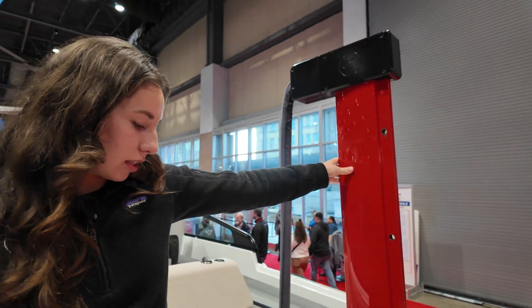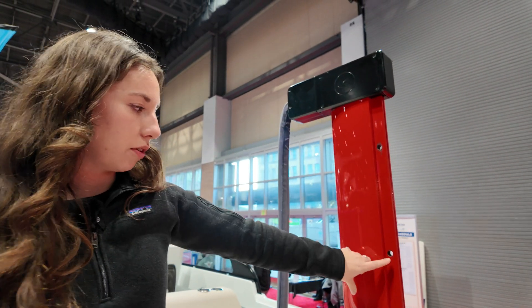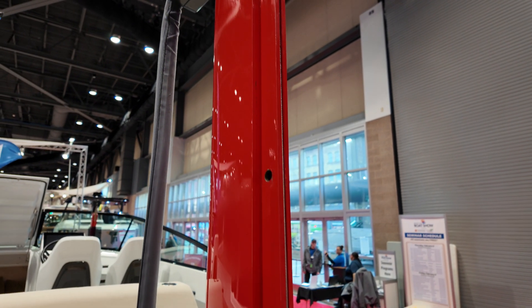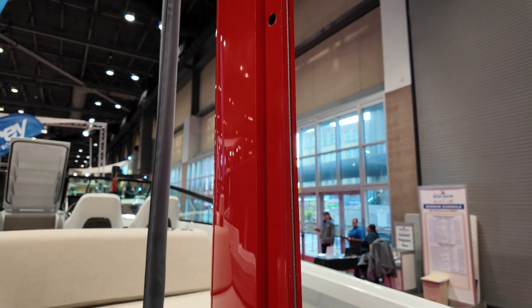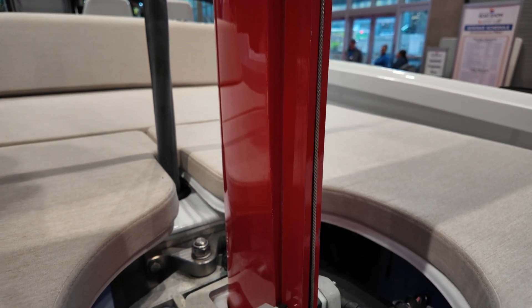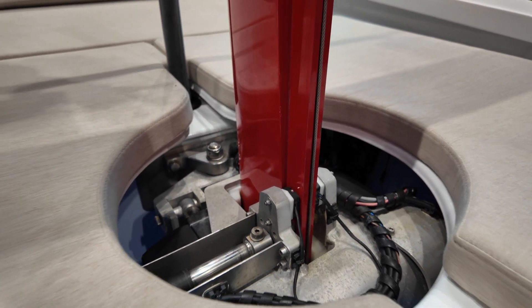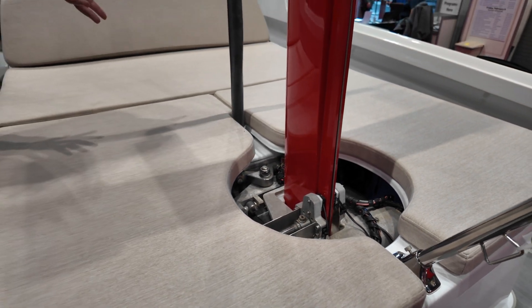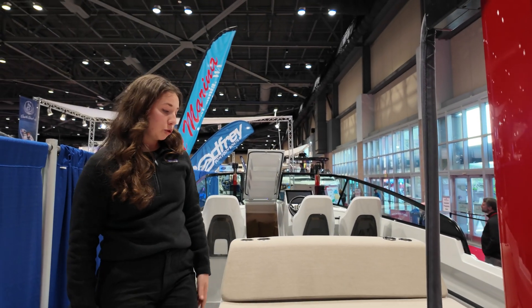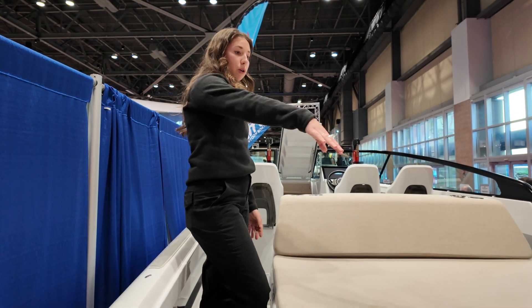This is the aft foil system — you've got different retraction modes and this is where the lock pin goes in. We have four separate modes of retraction: shallow mode, foiling mode, planing — which is to use it as you would a traditional vessel — or harbor mode, which pulls both foils pretty much completely out of the water so while you're at the dock you can reduce growth. You can trailer this boat just like a normal boat in shallow mode.